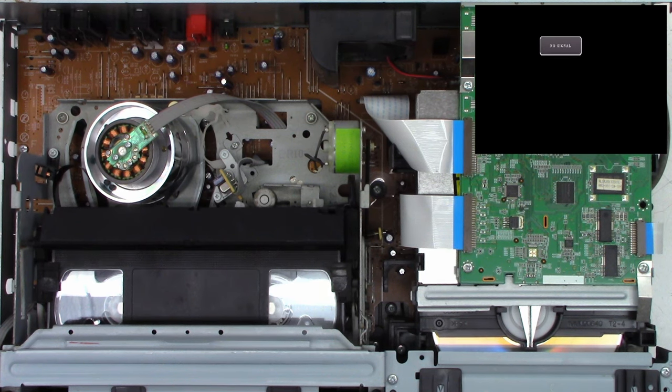Okay, so off camera, I did go ahead and service the mechanism, clean the entire tape path, clean the pinch roller, all the guides, the audio control erase head, the full erase head, the back tension arm, the angle guides, the upper and lower cylinder of the video heads. You've seen me do it 1,000 times, but I want to go ahead and check the auto head cleaner to see if it's going to be an issue in the future.